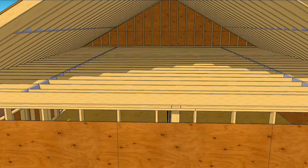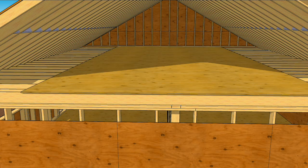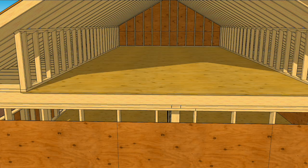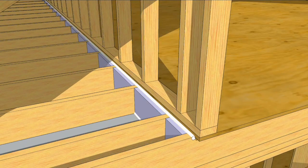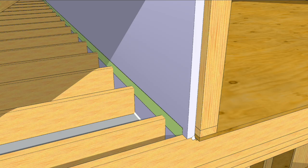It's a great idea to insulate below the floor for acoustical isolation. Now we can glue and screw that subfloor to the framing and frame the knee walls. Seal the edge of the subfloor to the foam blocks and add a layer of foam outside the knee wall. Tape that seam.